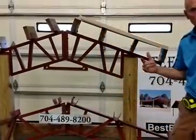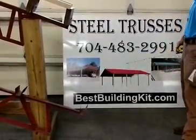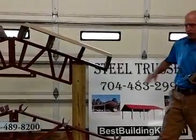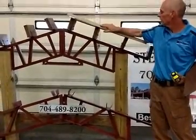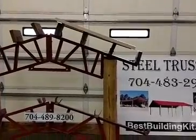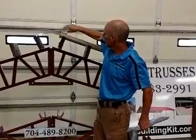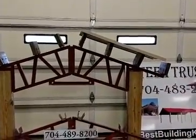Okay, when you buy one of our kits, all right, the kits come like this here, all the parts for a roof. We can do whole building kits, but typically our base price is for a shelter. You close in the walls if and when you want to. Now, what that comes with, you have your posts, you have your trusses with all the hardware, you have your purlins, you have your screws, you have your metal, your lumber, 2x6s, and all your metal, and this piece called the ridge cap. They typically come in 12 foot lengths, but that goes right on the ridge between your top 2 purlins. And the way that sits, right over your ribs, air can come in and out in there, so you have ventilation.